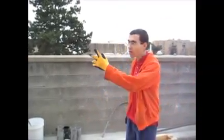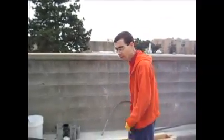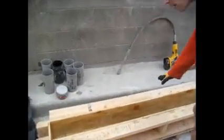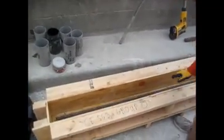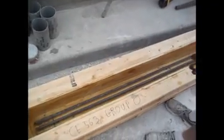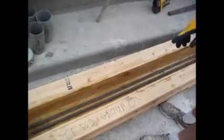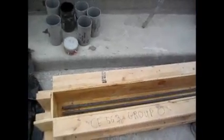In order for this to be successful, it's important that you're well prepared beforehand. So before you even think about putting stuff in the mixer, you need a few things ready. First of all, the beam — the sides of your form and bottom should be oiled, and your steel, whatever you're putting in there, should be in place with your cage and your chairs.